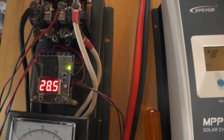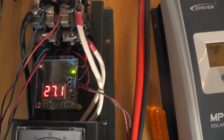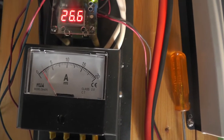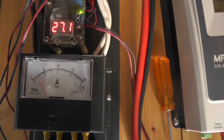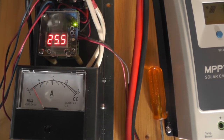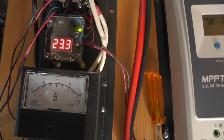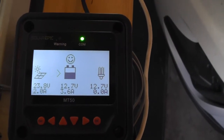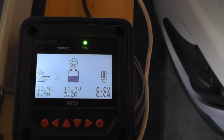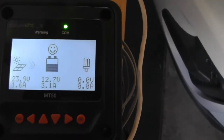It goes to around 27 or 30 volts. So it doesn't change the RPM of the water wheel by much. The amperage is around 2 amps — each one of them is a half an amp. So I'll release that again. It switches back. And if I turn my load off, I should see the battery voltage come back up.